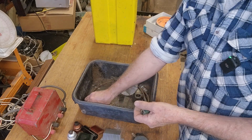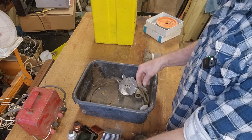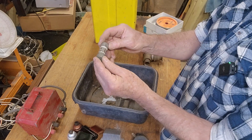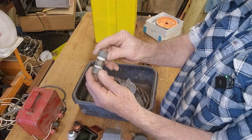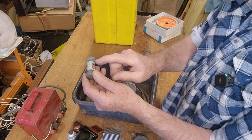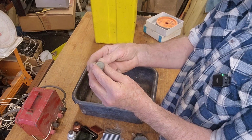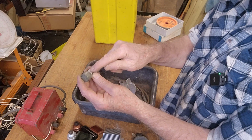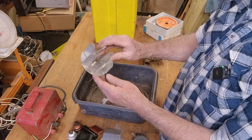A little brass nozzle, another brass valve thing there. We need to clean that up for our scrap brass bin. Another brass fitting. A really large fuse. Now these ends on these fuses are usually copper, tinned copper, and it's like a ceramic material in the middle, and if you break them they have like a sand and the fuse wire inside. There may be a little bit of silver in the wire, I'm not too sure, but it's probably worth just breaking it open just for the large copper ends on it. I'll go as number 2 copper.